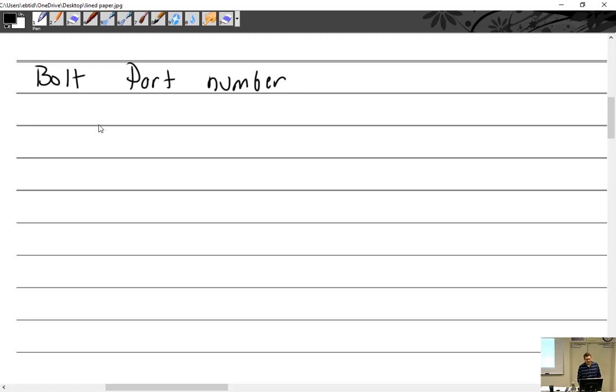A regular old bolt is called an AN bolt, so the part number starts with AN. The first digit is the diameter in sixteenths. So if I have an AN5, that means it's five-sixteenths. Then I have a dash. This dash can either be a dash, an H, or a C. A dash means it's cad plated. C means corrosion resistant steel — so it can never be a dash and a C at the same time.